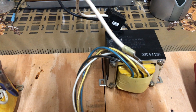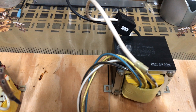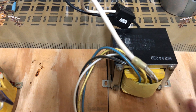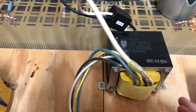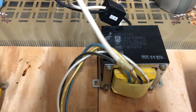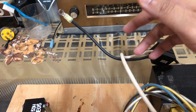One of the techniques you can use to properly identify the leads is to get an AC adapter — one that outputs AC volts. Do not get a DC adapter; if you do get a DC adapter, you may have to remove the rectifier. Look for an AC adapter that can output around 14 to 15 volts. You can find those adapters with computer speakers, or you can buy a small transformer and connect it directly to your outlet.